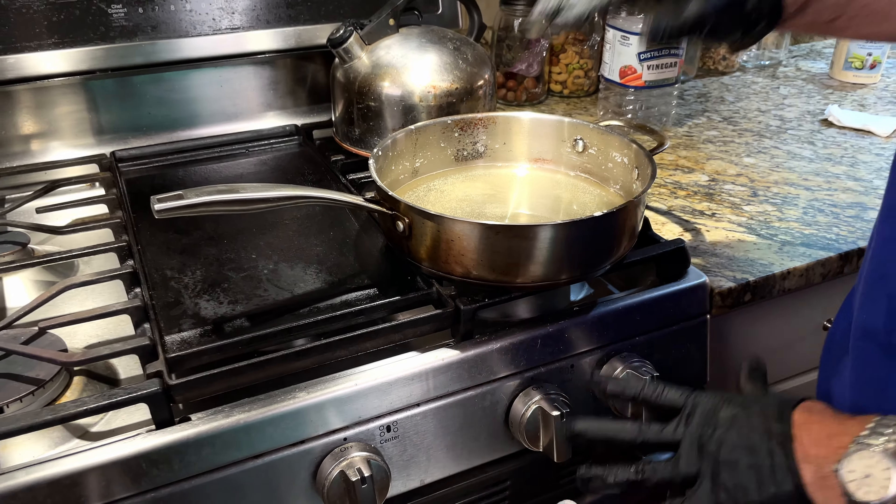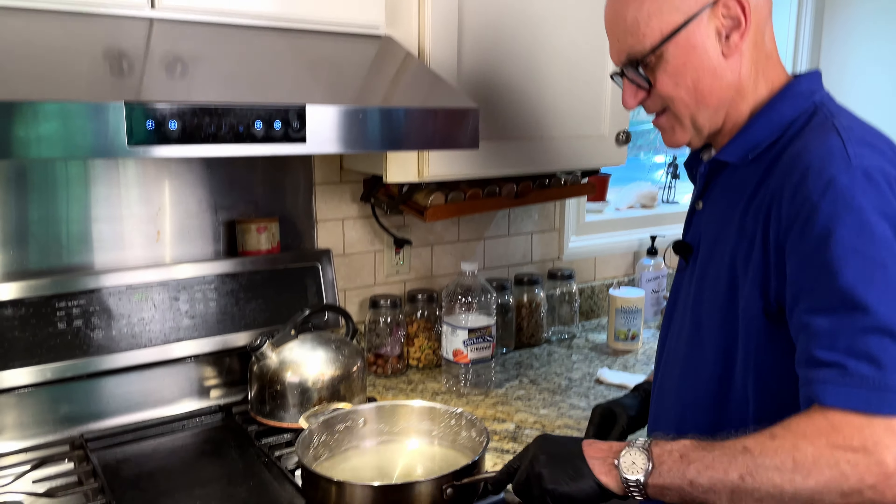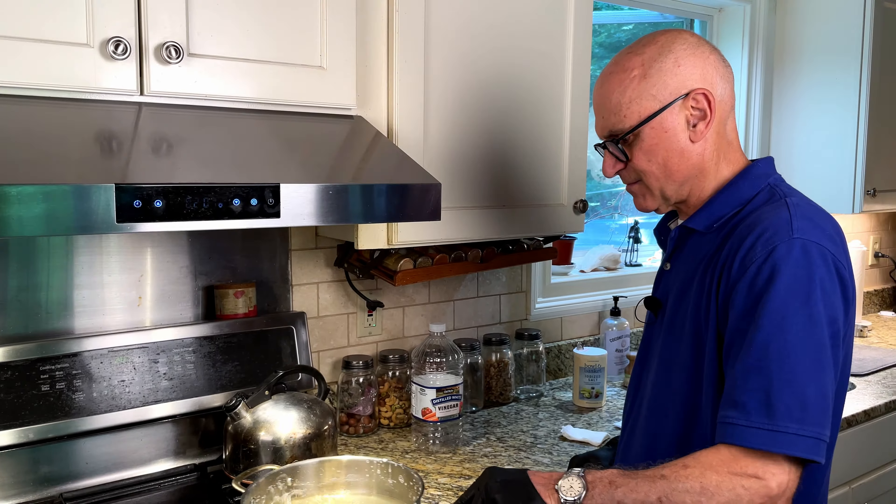It's just at the point of boiling, so I'm going to turn it off. Mix it around a little bit carefully just to dissolve the last bit of that salt. Take the tea kettle and set it right in there — I partially filled the tea kettle with water just as ballast so it doesn't float. Make sure it's sitting right down at the bottom. Now we're just going to wait a good six to ten minutes, depending on how badly tarnished it is.